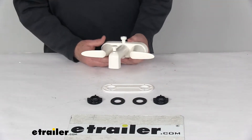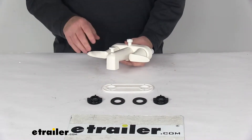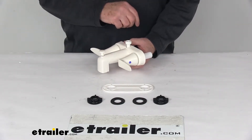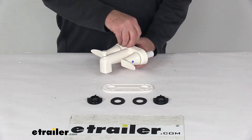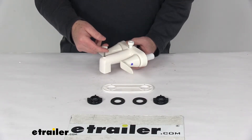This Catalina Series Tub and Shower Diverter Faucet will let you upgrade the diverter faucet in your RV or camper. It has this D-Spud outlet on the top here. It allows you to attach a handheld shower. The handheld shower we do sell separately on our website. Basically when that's hooked to this D-Spud, then you just lift this diverter pin up to activate the shower.